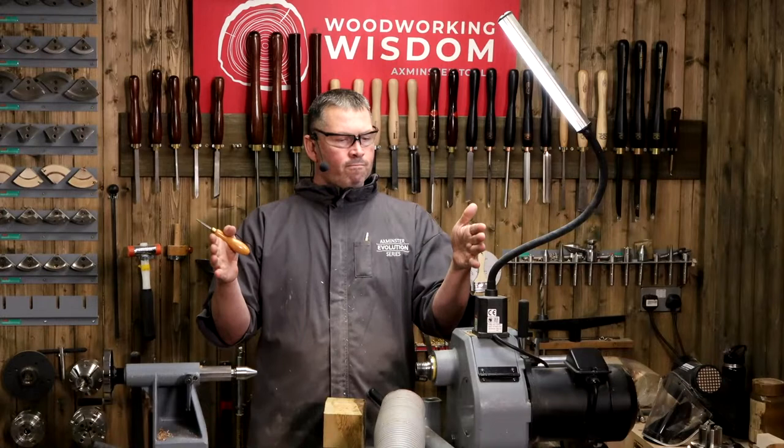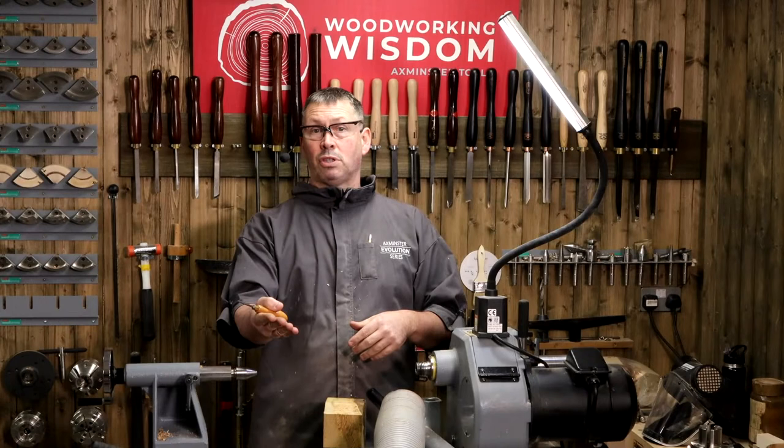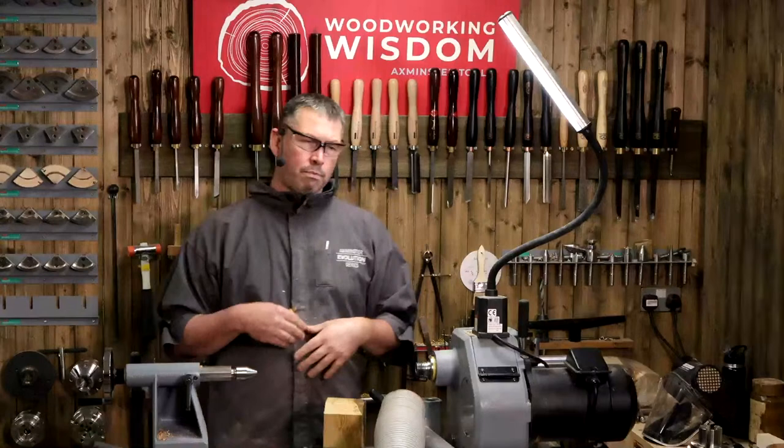And that bowl will be ready to return within a year. Where if we go by the year per inch plus one rule, it would be 7 to 8 years before it would be dry enough to turn. So for us, it's a huge, huge thing. Much cheaper way of working, much quicker way of working as well.